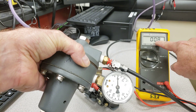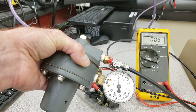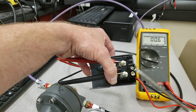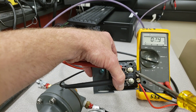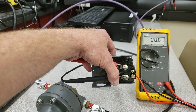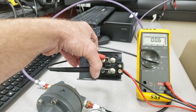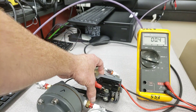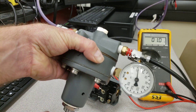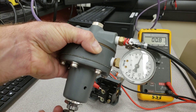Now it's giving us something that looks more like a short circuit — we have continuity. I need this to kick in at a higher pressure, so I need to adjust the whole range of values using the left set screw. I want to increase the whole range — every full turn is about 3 psi. By adjusting that set screw while the switch is already kicked in, it doesn't change the current state, but let's see what happens when I increase the pressure, because I need it to kick out at 40.